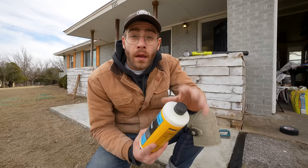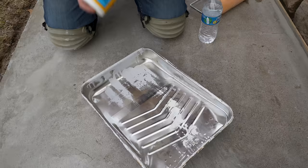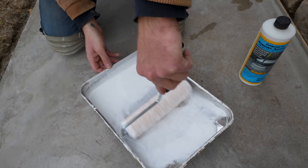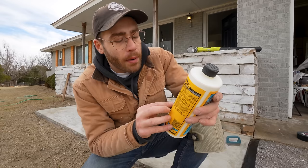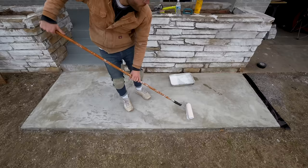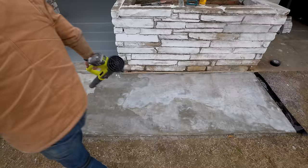The directions on my concrete top coat don't require a bonding primer, but I want the best results possible so I'll use a roller to apply a coat of it. The directions say to dilute one part bonding adhesive to two parts water, but I went with a slightly more concentrated mix. Once this dries it'll finally be time to do our concrete recap — after a word from today's sponsor, Squarespace.